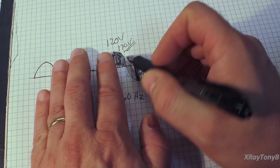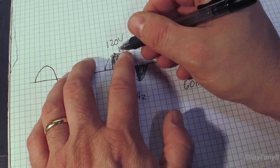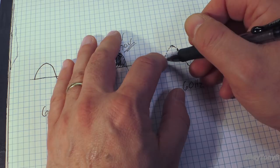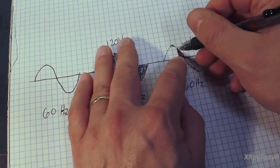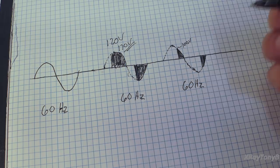At maximum output, you'd be applying 170 volts to the primary of the transformer, giving maximum voltage output. But what if we wait? If we take that TRIAC, wait past the peak, and on the downswing of the cycle, say at 100 volts, fire the TRIAC - I am only going to apply 100 volts to that primary at that point in time. Because of the inductor behavior, you will eventually have an output that's actually lower than if you fired the TRIAC at its peak.